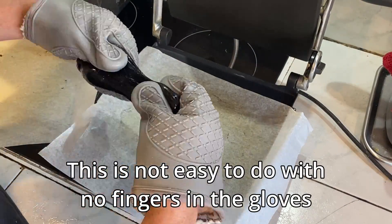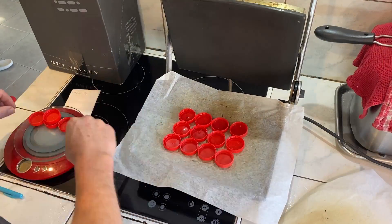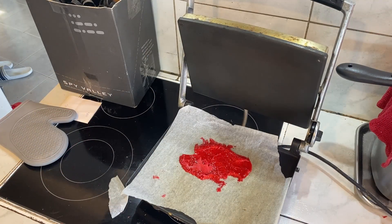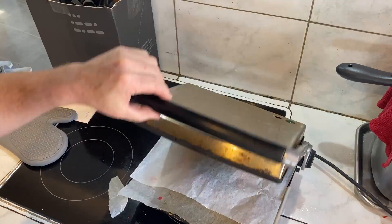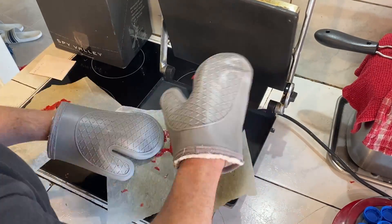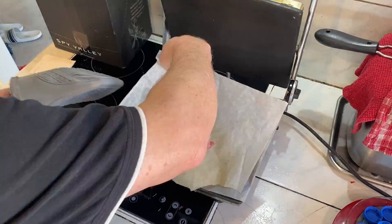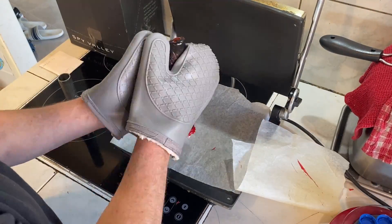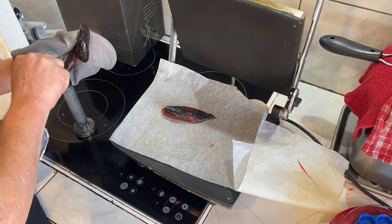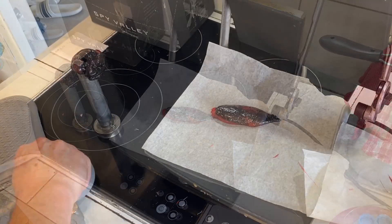On the YouTube videos they tell you to fold the plastic over and fold it over and put it back in again, so I did that a few times. I melt down some red bottle tops and mix the black and the red together. I mixed this maybe a little bit too much — as you'll see later the end result was almost completely black. I preheated the mold so it's hot, and this is the difficult part: trying to get the molten plastic into the mold. I'm pushing it down with a screw, which really mixed up the colors and I think that's another reason why it turned out black.